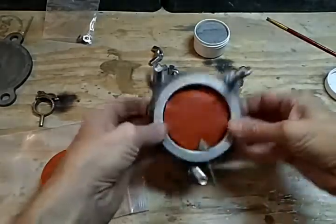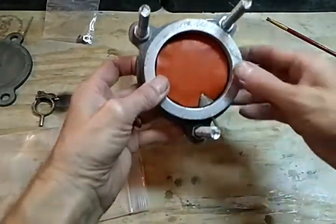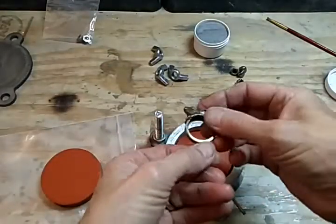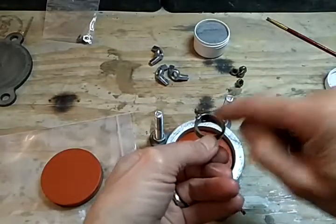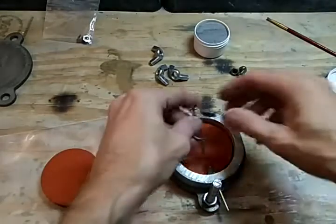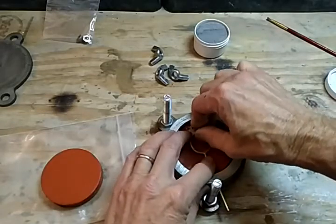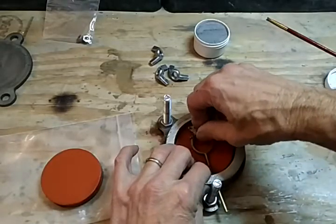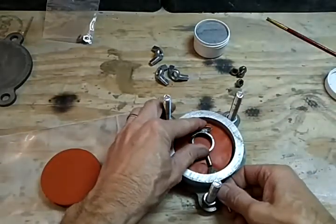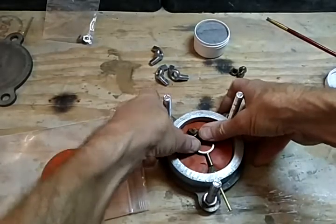We don't talc this piece because we want the two to adhere together. Then we take the mold frame and just push that down — so it's going to look like that, with the cone coming up. I have this bunny ring; it's got a negative area underneath and I need to make a mold of it, so I take the sprue rod and line it up with the cone.